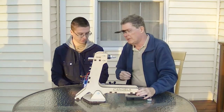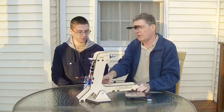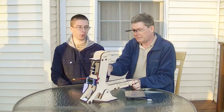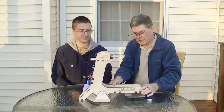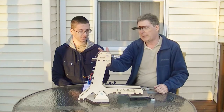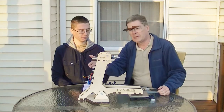You can also test out your ESCs to find out which ESC is going to work the best for you — without going poof on you, or getting too hot — and measuring the amperage and getting the thrust down here on the scale. And then we have the tachometer, because different motors have different RPM, so there's another issue.